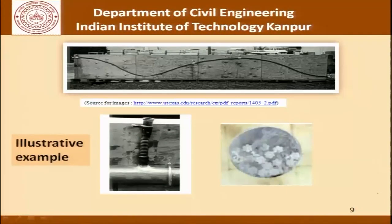This is an illustrative example showing the tendon profile as provided by the designer and the concrete beam. The concrete has been cast, the tendon follows the shape of the duct, and if it has to be grouted, that is what the grout will fill. Obviously we are talking of very small cavities where the passage for the grout is very narrow. We cannot place concrete there — no coarse aggregate, and even fine aggregate is a big issue since we may not be able to put even 2–3 mm sand in it.